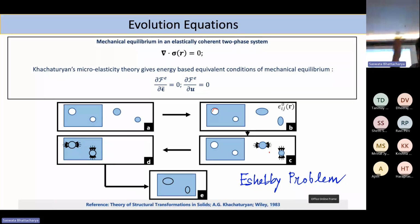Please understand, that is one of the reasons why we use superalloys like nickel-based superalloys, where the misfit strain is also low. Even the interfacial energy is very, very low. It can be as low as 10, 12, 20 millijoules per meter squared. That is important because if the precipitates coarsen and become very big, they lose strength. You have all learned precipitation hardening, isn't it? In precipitation hardening, if you have very large incoherent precipitates, dislocations can easily bypass them using something called Orowan bypass.